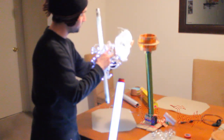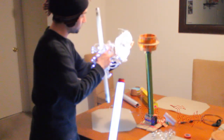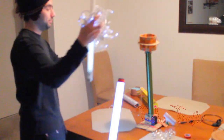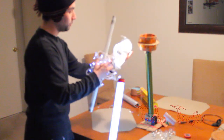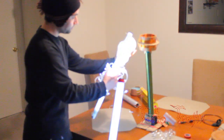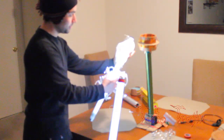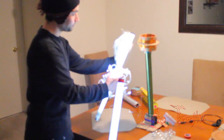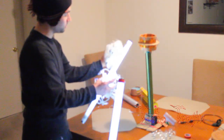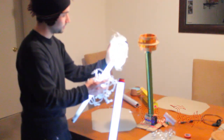Running at 19 volts in at about 500 milliamps. I've proved this in previous videos and other individuals have proved that no matter how many bulbs you add to the ambient surrounding, the current really doesn't change all that much. The bulbs do get a little dimmer, but the reality is you're getting a lot of power transmitted wirelessly.